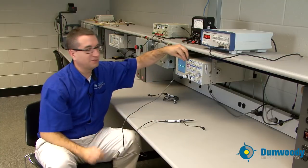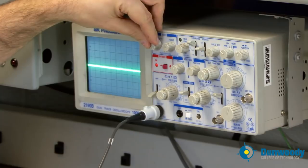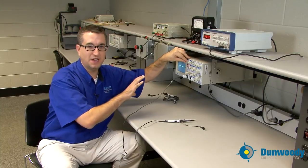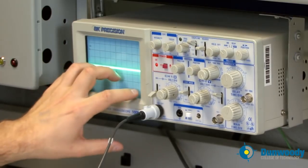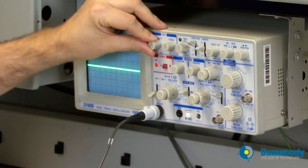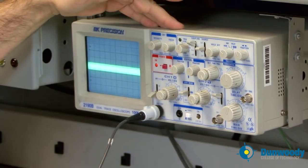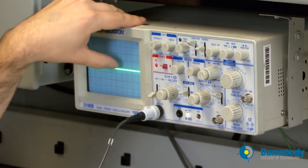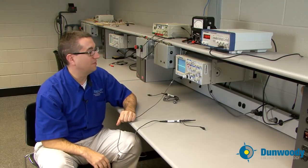A couple of key features: the first is intensity. When you turn the intensity up it gets very bright. This is a phosphorous screen, so keep that intensity in check — you wouldn't want to leave it all the way bright and walk away for several hours, as it's possible to burn an image into the oscilloscope. Your screen saver is simply turning the intensity knob down. There's also a focus control that takes you from a blurry line to a crisp, sharp line, and you really want that line crisp so you can accurately count divisions.